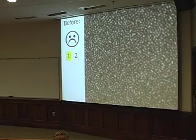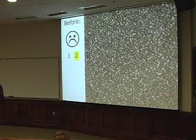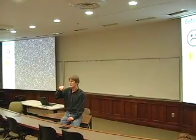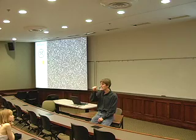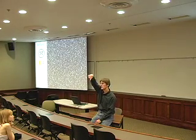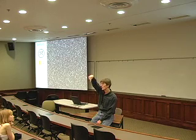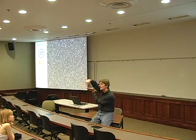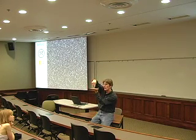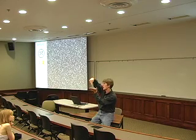There's this thing that happens when you take an atomic force microscope picture. It turns out that it's very hard to get a picture that's really exact and precise and isn't at least a little bit distorted. And the problem is this. Fundamentally, you have to image by holding this tip above the surface and scanning back and forth. So you really have to position this very carefully to within about a nanometer. And the problem is that positioning can drift over time.